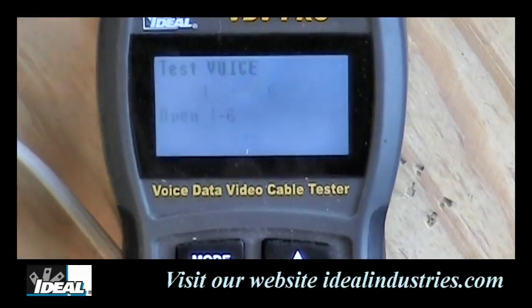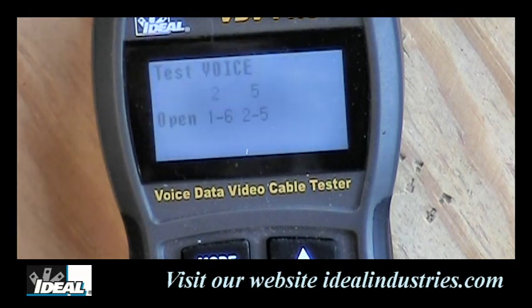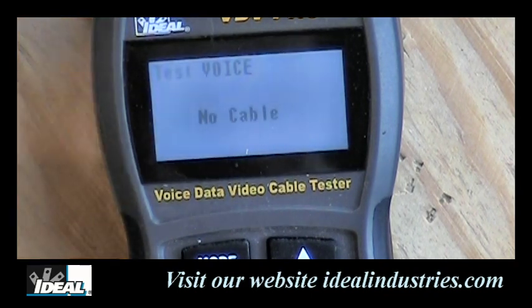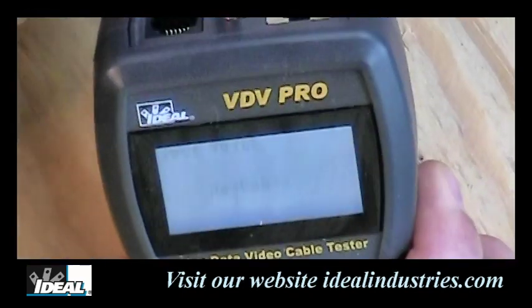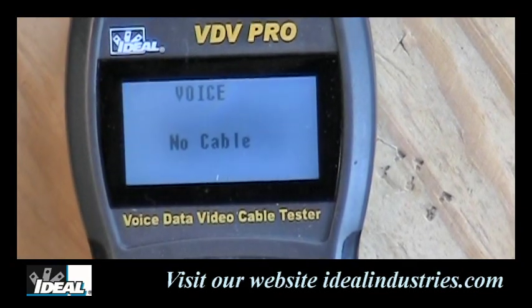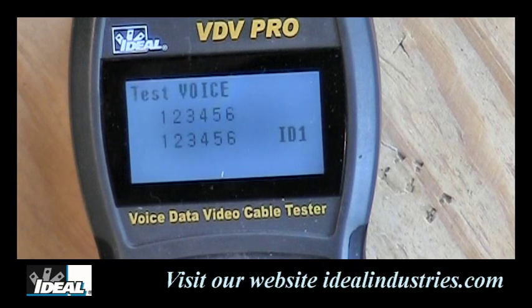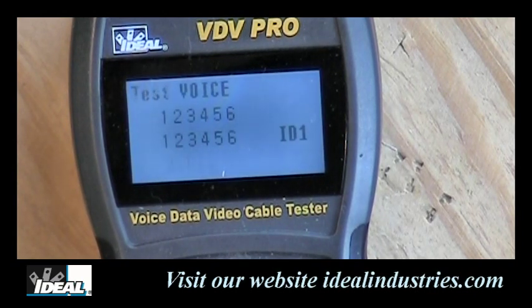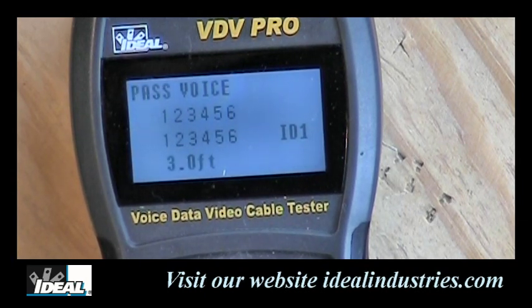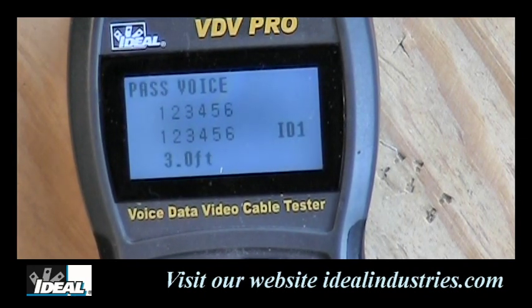Now, lastly, if I put a cable into the remote that has 6 pins in it, and plug the other end of that into the top of the tester here, it's now going to look at a cable that's got all 6 wires in it, and they match both rows, pins 1 through 6. You hear it beeping, indicating that it sees a good cable. Okay, we're about 3 foot in length there. And so that would make the actual tester say pass. So in phone testing, you might be looking for any one of those, depending on the phone you have and the wiring you have.